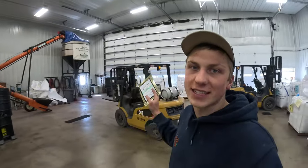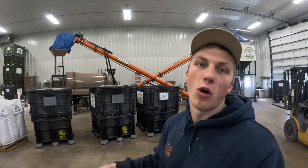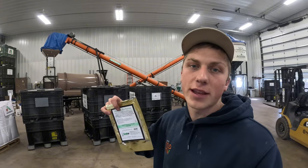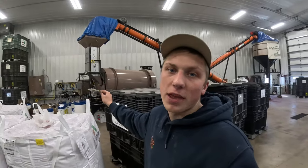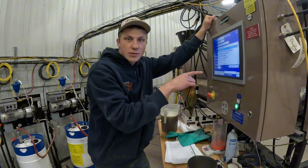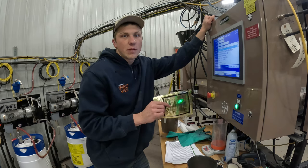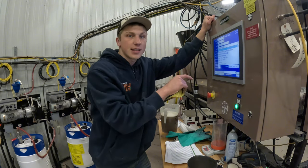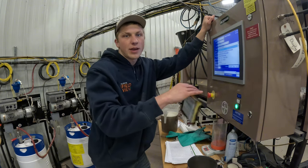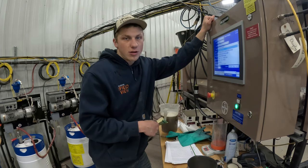We just finished those previous eight 18 XF1s. Now we're switching over to some 19 XF3s, and on this next bean — since we're putting it on a field with a little bit higher pressure of white mold — we're actually putting on some Heads Up soybean treatment to help protect against white mold. So we need to mix up a different chemical and change around the recipe on the treater. I'm not finding the correct recipe in the computer on the treater, which means I need to go to the computer, find the correct recipe, and get it approved by a chemist to make sure we have the right formulation.